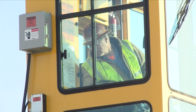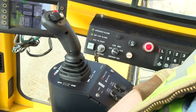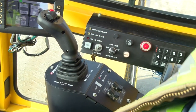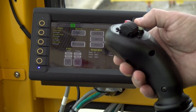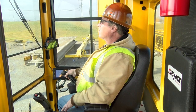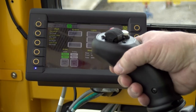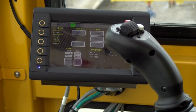To activate sync mode, first ensure the area around the load is clear and that ground crew are a safe distance away. Then press the trolley sync or hoist sync button located on the right joystick control. The corresponding sync indicator light on the HMI will illuminate to indicate synchronization. Select an actuated joystick; the first joystick actuated will be active as the joystick in control. Once synchronized, the system maintains synchronization until the operator presses the sync button again to end synchronization. To end sync mode, press the sync button for the sync mode you wish to end, located on the right controlled joystick.